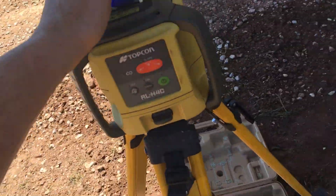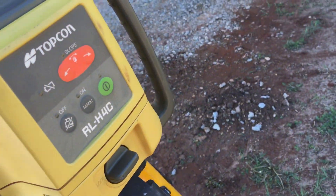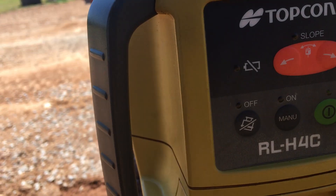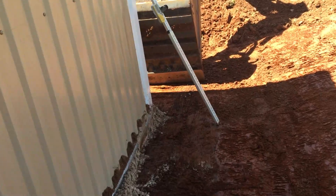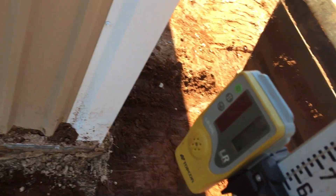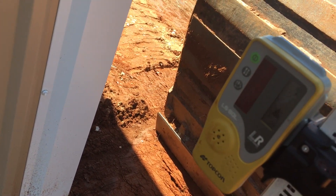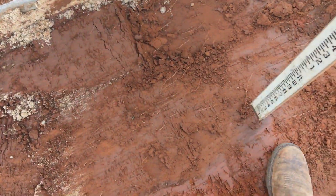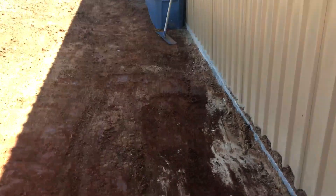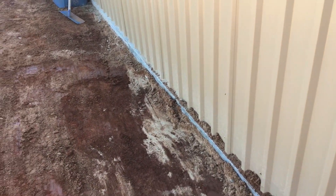When I restart it, it's going to blink until it resets — it's leveling inside. This will show how much fall we have. I didn't have a whole lot, but if we see now — we've got about two inches, which isn't bad for what, 30 to 40 feet. We've got two inches of fall there.